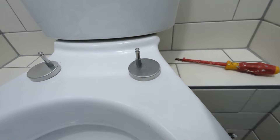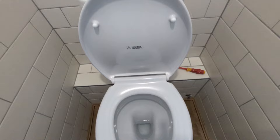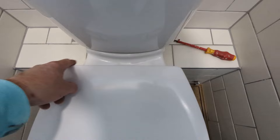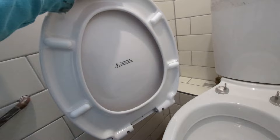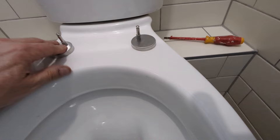That cap has a pre-drilled hole and it's ready to go. So remember: take the seat, line it up with the holes, lock it into position so you hear the click, and there you have it — a soft close toilet seat. Now there's one other thing worth noting: these toilet seats are fantastic for cleaning. Traditionally cleaning around the toilet fixings was very difficult and you could never quite get to all of it. With these modern seats it's absolutely amazing — lift it up, pop the quick release buttons on both sides, the seat comes off, and you can clean really, really easily.